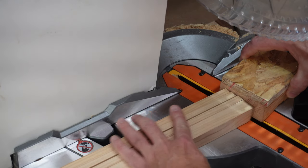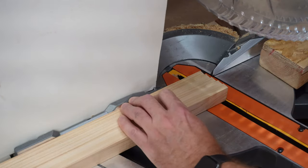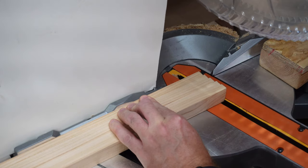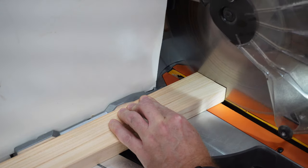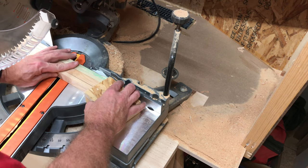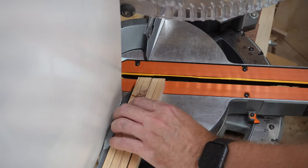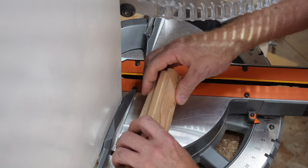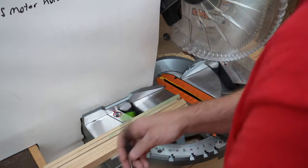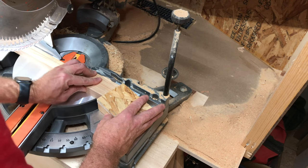Take 5 strips and stack them so that the narrow edge is facing up, and stagger them a bit to make your first cut. I use a block of wood to line them up and then make a miter cut. After you make your first cut, take your whole stack and flip it. Then measure from the long point and make your mark just on the edge of the longest slat. Then slide your 5 strips over to the right, making sure that your beveled ends are all lining up nice and tight, and then make your cut just outside your mark.